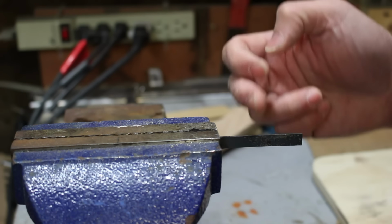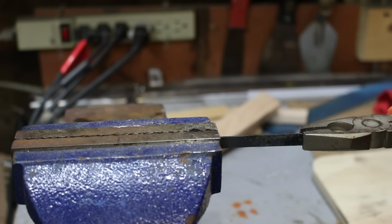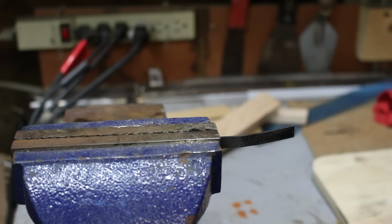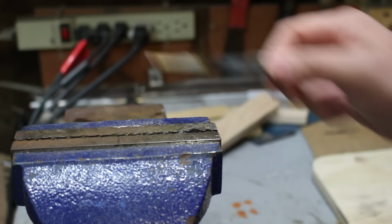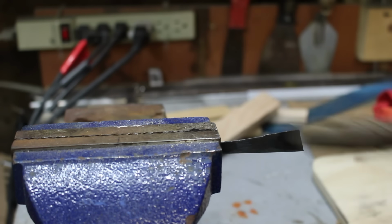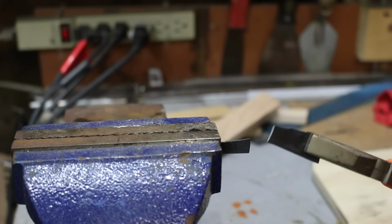Bend test. I've heated this part of it right here. If I pull on this, or I should say apply a force on this, this should bend. And look, it bends. No problem. Super malleable. I'm bending this with my hand. Not an issue. Okay, mild steel. Come back to the high carbon steel. I'm hitting it. Doesn't bend. Snaps. That is because it was hardened.